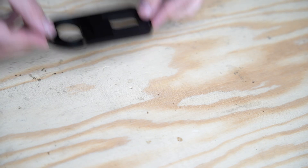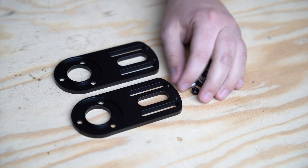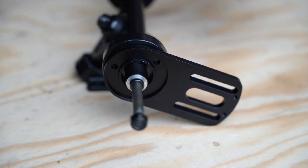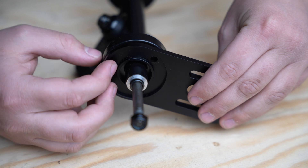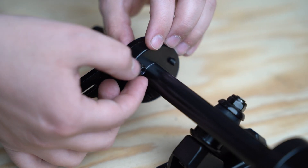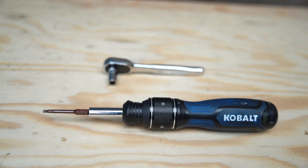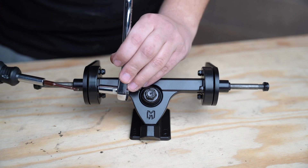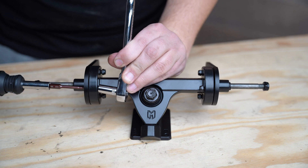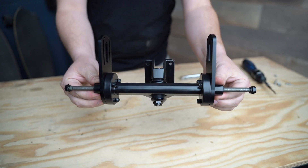Find the truck box and grab the rear trucks. From the component box you'll need the two motor mounts and the drivetrain assembly hardware. First slide the motor mount over the axle and align the mounting holes. Secure your motor mount to the rear truck using the M5 screws and nuts. We've included all the necessary tools in your kit, but if you have your own tools that are better, you'll save a good amount of time. Using the included allen key and wrench, tighten the motor mounts to the rear truck.